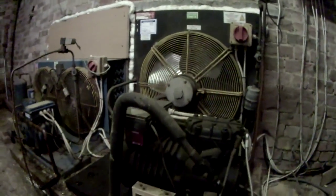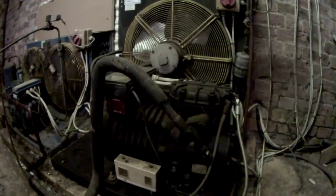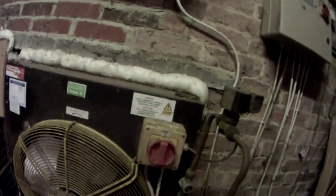Call to this unit that's cycling. It's very oily around the sight glass area. Doesn't seem to be much oil in there, so maybe it's lost its gas out of there. The whole pot of the unit is oily. Let me turn it on and see what it does.